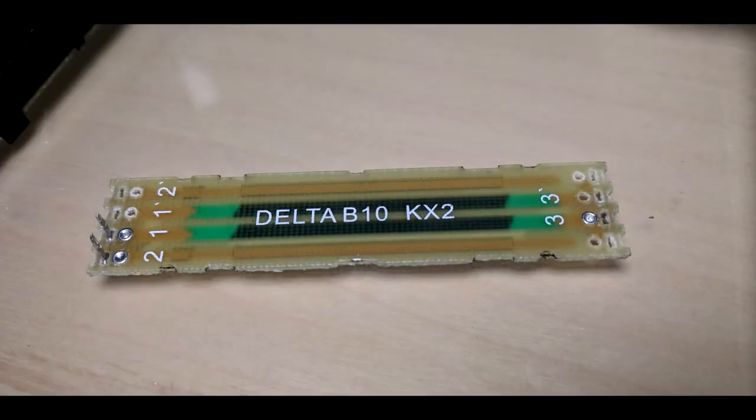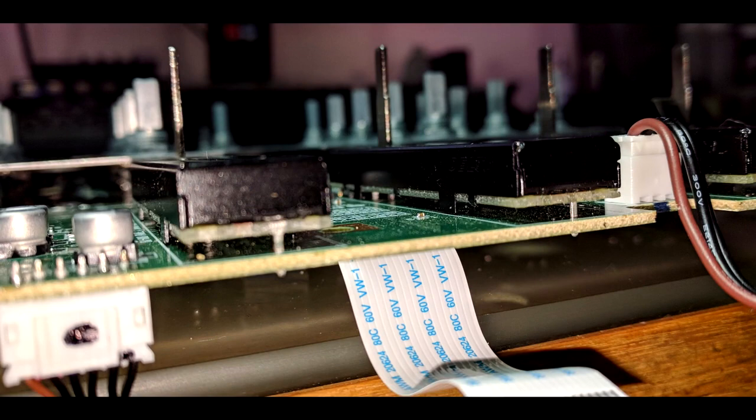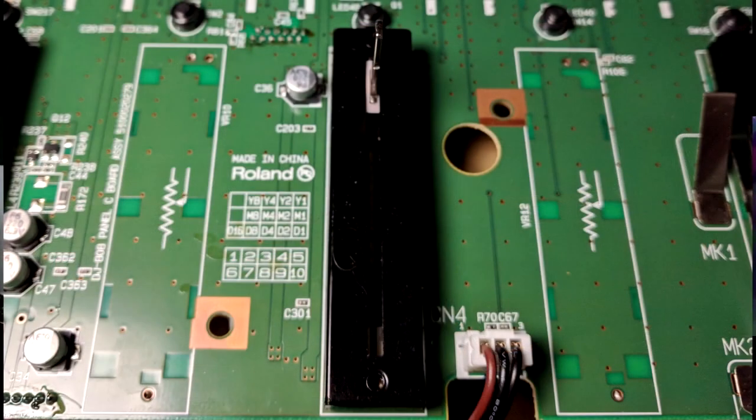It's the mounting method. On the PCB, which is the mixer section, they have three holes for each fader — two on the top of the fader and one on the bottom — which are the common terminals used for that style of potentiometer, a slide potentiometer, aka a fader. But what was holding it down onto the board, or onto the faceplate, or anything, so that a human can interact with it in a vigorous way? Just the terminals. The three little half-a-millimeter-thick wires that go into the actual mixer. That's it.